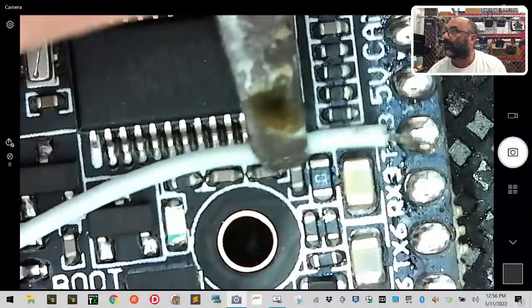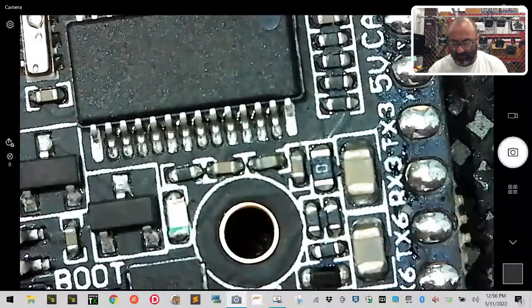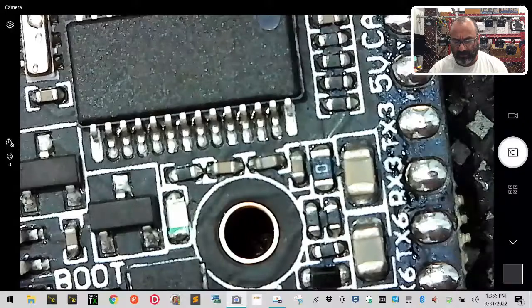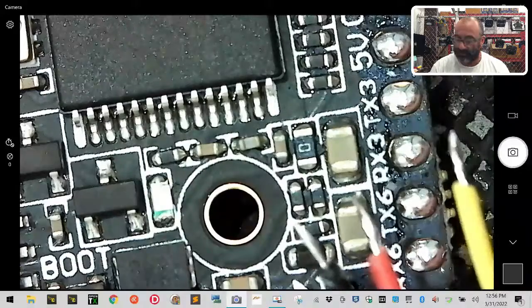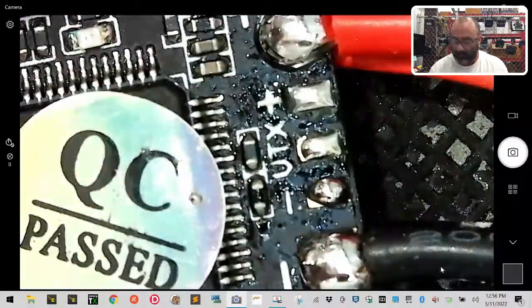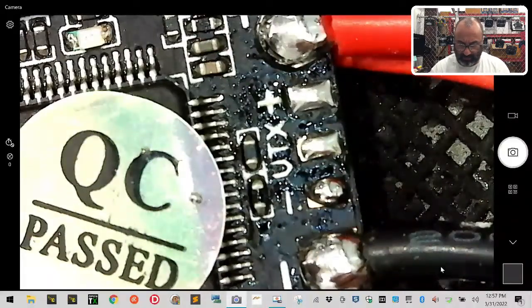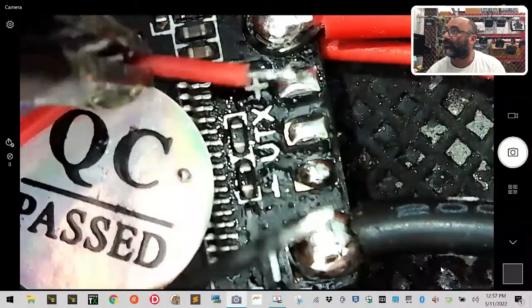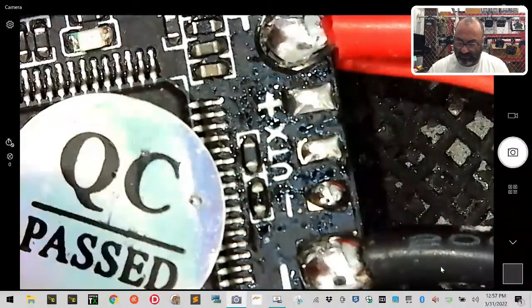It's a little long but not too bad — just trim these back slightly. Actually the lengths are pretty good; the red and the black are going to go back here along with the VTX. I'll try to solder this under the microscope so you can see what I'm doing. I'm going to trim the black back just a little too — just have enough wire to reach the pad.